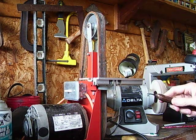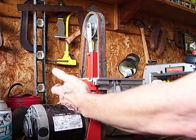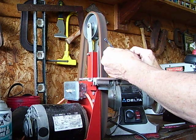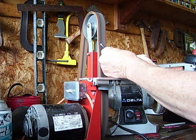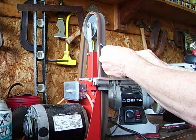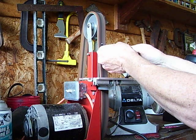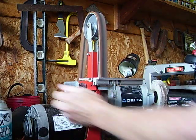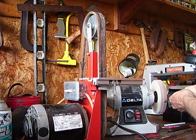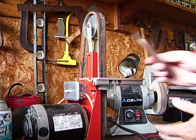You've got to be careful. And that's the only sharpening that I do. On the v-tool, I sharpen my v-tool like this. A lot of people try to sharpen one side and then sharpen the other. On the v-tool, it's just like a curve — let your motion go like this, to sharpen the outside of it. I'll take it and kind of put it in between the belt a little bit. But that's how I sharpen my v-tool. Then I come over here and knock off the little burrs on it. I just love this thing — it's a wonderful tool. And that's how I keep my knife sharp.